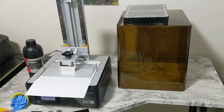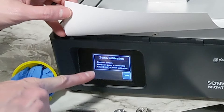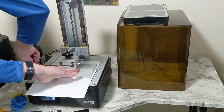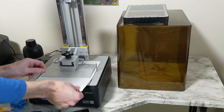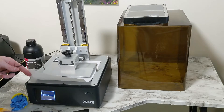The plate slides into position, goes back up, and then slowly comes back down to that same position. At that point you can hold it steady and tighten the screws — I tighten from opposite ends to keep it level the whole time. If done right, the paper should not slide out when you tug on it. When that feels good, push done and it will raise your build plate back up to the top.